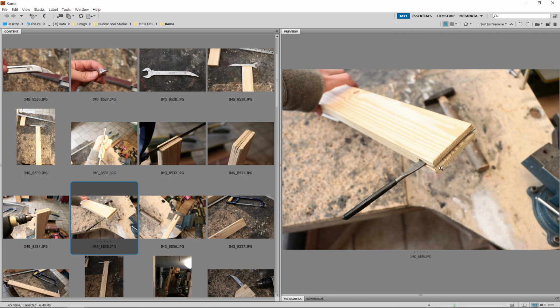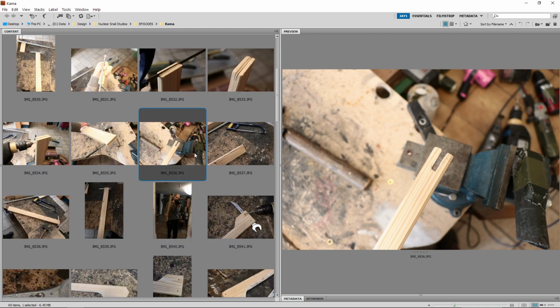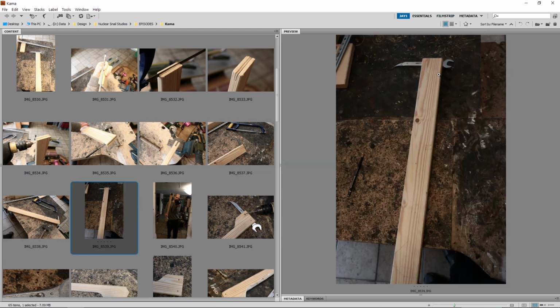Then I use the file, which is a metal file, which didn't work that well on wood, but still I use it to clean up the slot a bit, because what I want to avoid is that the slot is too narrow, because then the wrench would just tear the wood apart along the grain. This is literally how you split wood, and that's what I do not want to happen here. When the slot is done, I just slot it in, and in a pinch, in a zombie apocalypse, I guess, I could already use this.